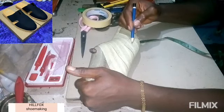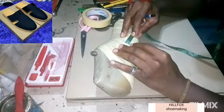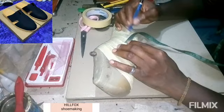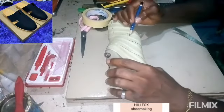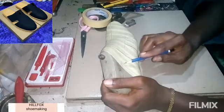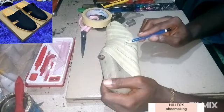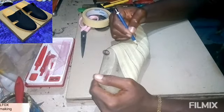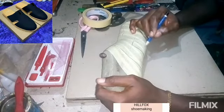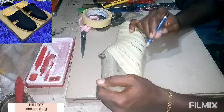Take another measurement from here down to this point: 0.8 inch. Take the line again from that point — you see the quarter line here, so that is where the line is going to stop, at the quarter line. With that we already have the design, the opening at the side here.